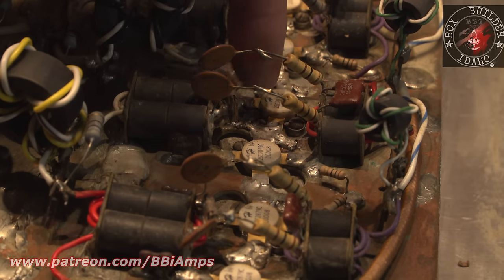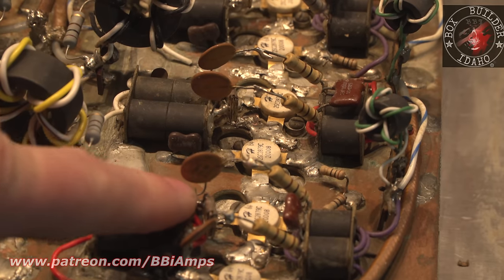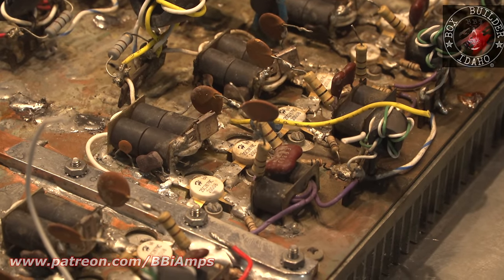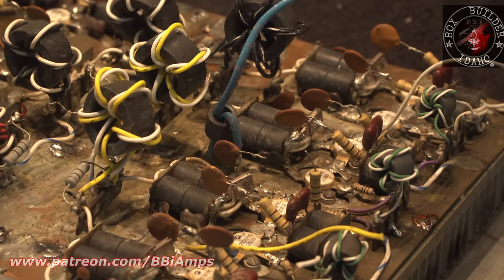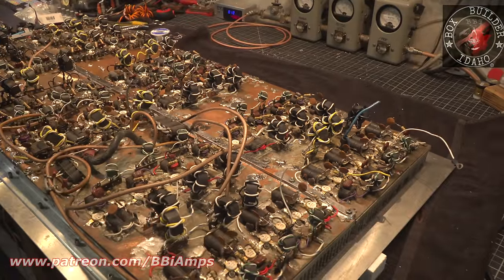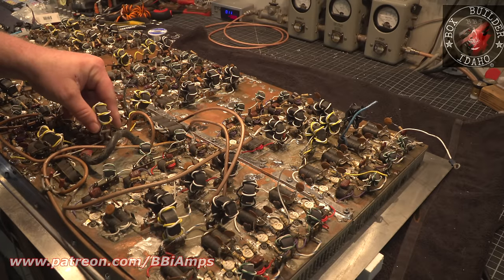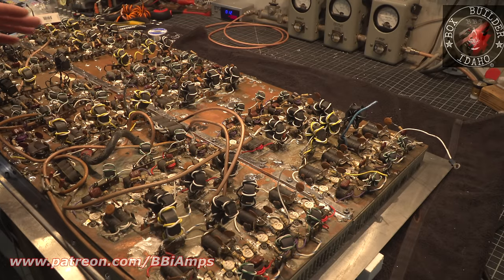So I've got to go pull each transistor, clean up this level of solder work, right? And then some of the solder work going from the transformers down to the transistors is just scary. So then I've got to clean each pill pocket out as I go. So a lot of this, and I mean a lot of this, you guys are going to be surprised. I was sitting there thinking about it last night. The only place that we need these larger toroids is here at the final combiner stage. We don't need to have this big heavy mass hanging out here.